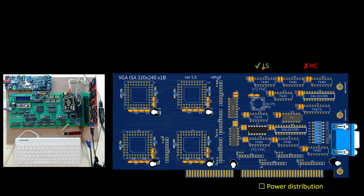But that is something I know I'm running into. And I will note at this point, I am still running 9 megahertz for the processor. I have everything running using a 36 megahertz oscillator, which is 18 into my system and 9 at the processor here. So that's what you'll see.